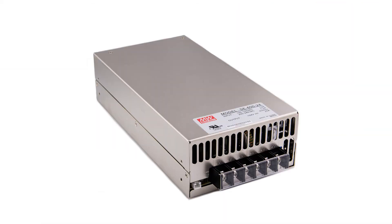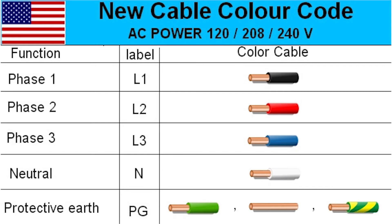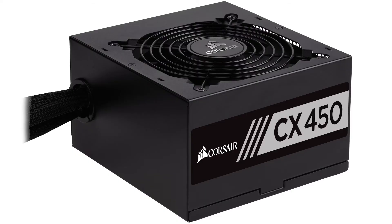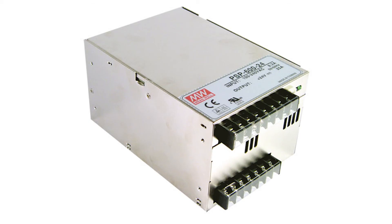Now connect the power supply. If you have an always-on power supply like any of the standard power supplies that ship with 3D printers or like a Meanwell SE series, you need to connect the regular AC cable to the relay board. If you are European it will be the brown wire, and if you are from the US it will be the black one — connect those to the relay board as shown on screen. If you have an ATX power supply, connect the two pins from the 24-pin motherboard connector to the relay. If you have a different PSU with remote control function like the Meanwell PSP series, connect the RC and RCG wires to the relay board, again as shown on screen.